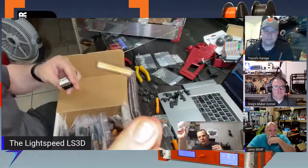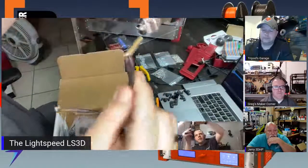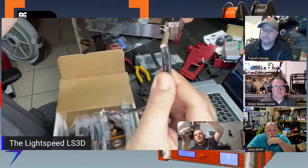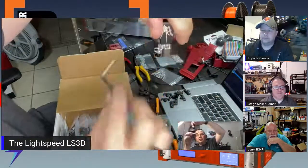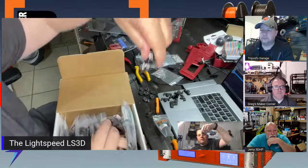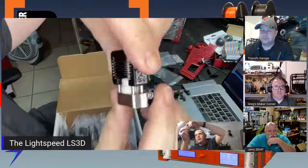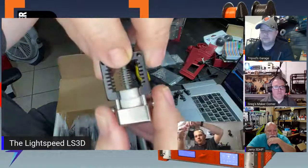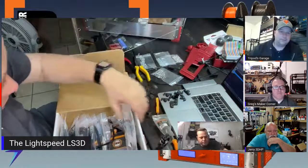But this is a slice 50-watt heater. This is one I used for a really long time. You see it's broken. But basically, you put the paste in there. This fits perfectly inside of here. You almost don't need the thermal paste, it's kind of an afterthought, I think. But yeah, this is the hot end, and you can see this is copper, and inside of here is a surgical stainless steel tube.